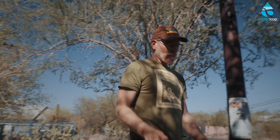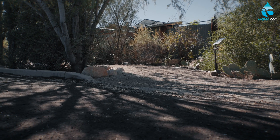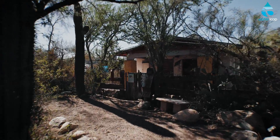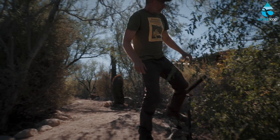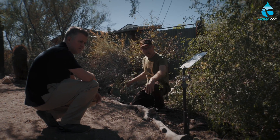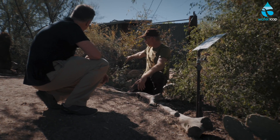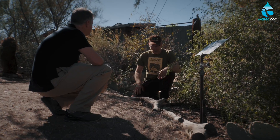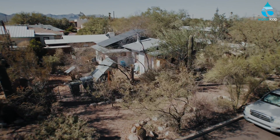We started planting the rain using an existing dip in the curb where there had once been a driveway. In big rain events, water would pour down the old driveway, into the carport, out the back door, and flood the neighbor — so we wanted to turn that liability into an asset. We created an earthen berm armored with rock that allows this whole area to fill with water — acting as a rain gauge with up to 12-inch depth, or two feet at the lower elevation. All that water rapidly infiltrates in less than an hour, so there are no puddles for mosquitoes.